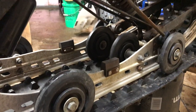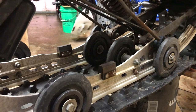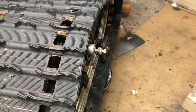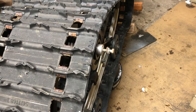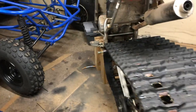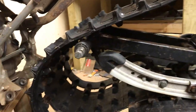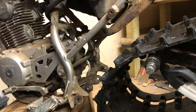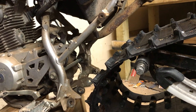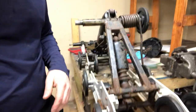My research shows that most timber sleds are about 11.5 to 12.5 inches wide on the track. This one is 15 inches. If I take an inch and a half off each side, we're looking at 12 inches altogether. We'll be cutting this and reworking the idler wheels and suspension in a way that works for the setup, then figuring out how wide to make the attachments and how to hook it up. I'm looking to narrow things out.